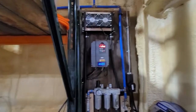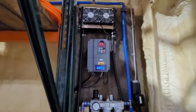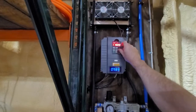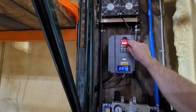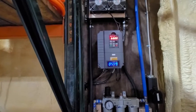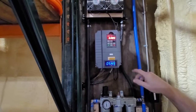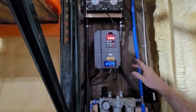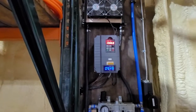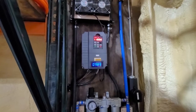I'll go ahead and turn it on so you can watch the VFD. I also have adjustable speed — I can turn it way down and across the shop it's significantly quieter. If I'm just running the air chuck on the mill or other light tasks and don't need a lot of air, that's great. When I want a lot of air for the plasma table I'll turn it back up. I also added a tachometer so I know the speed the motor is running at.